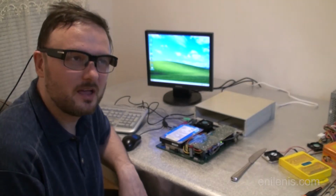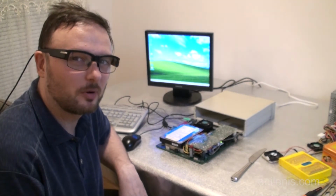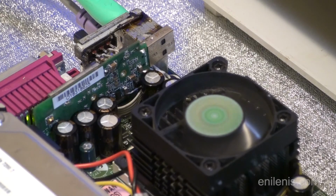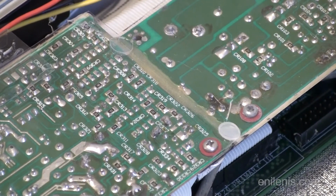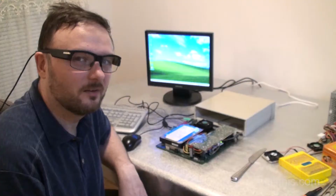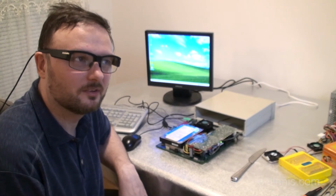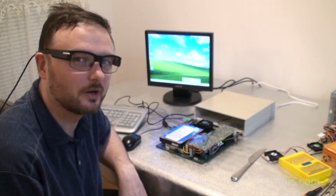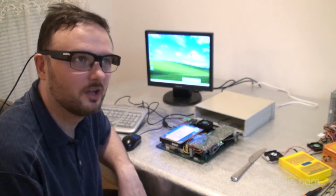So far so good, but I'm noticing that unlike with the full-size power supply, the CPU fan is changing its RPM slightly, which makes me believe that the 12-volt rail of the power supply may be running unstable. Later on I will connect an electrical tester or maybe even an oscilloscope to observe exactly what is going on, if it's able to handle the load.